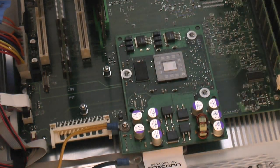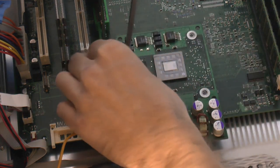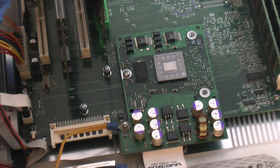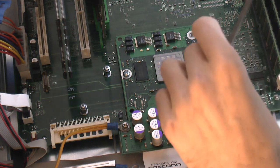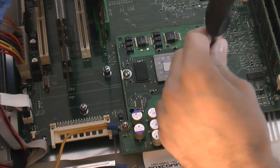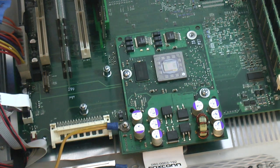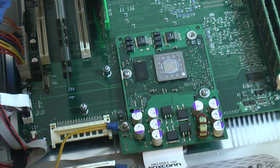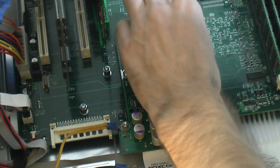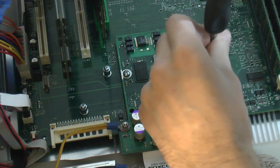Seems like it's a little bit squishy. Pretty soft pads these, I bought them on eBay, like most people probably do. So, on the top side here, I estimate about 1 millimeter. The thing with this, the probably flip chip, is that the top of the chip is not the best heat conductor. Most of the heat goes into this border. But it doesn't mean heat doesn't go up, so I'm trying to pull some of the heat out of it just to make them last longer and be more reliable.